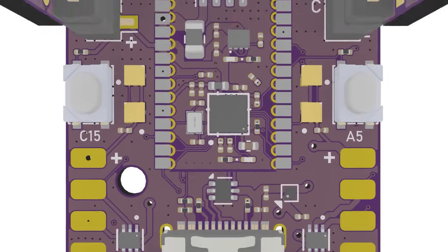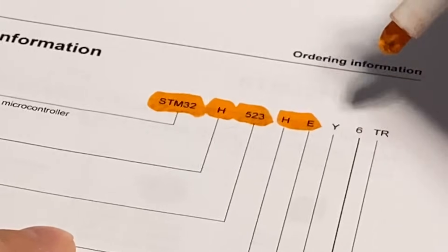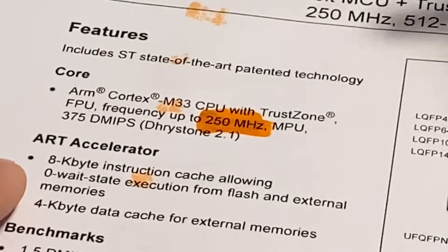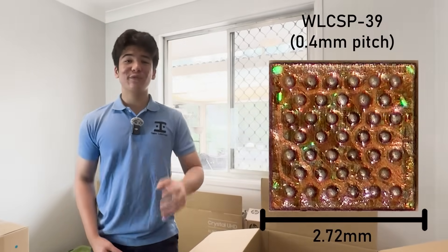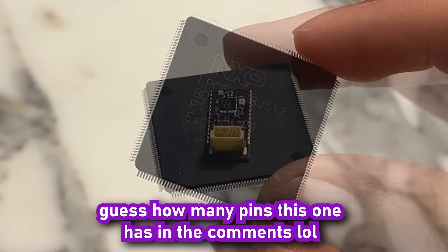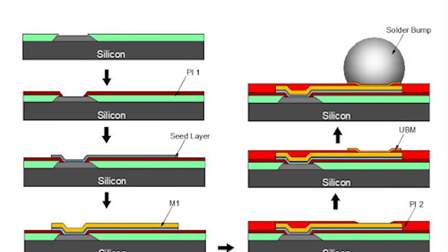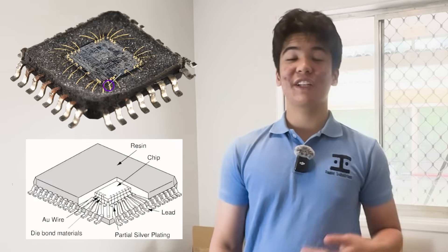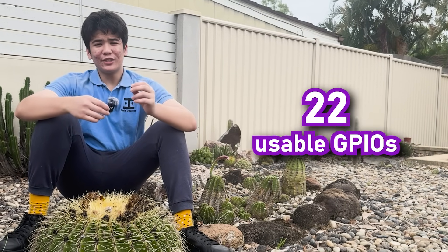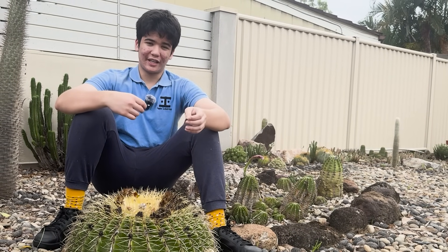First, let's talk about the microcontroller I chose: the STM32 H523HEY6TR, which crams a 250MHz processor into a wafer-level package that is four to five times smaller compared to your average QFN or QFP. It does this by putting the electrical connections to the PCB straight underneath the silicon die, instead of having long copper wires going out to a lead frame. Our chip has 22 usable GPIOs within its 39-pin package, so it's safe to say we'll have enough for those tiny robots.